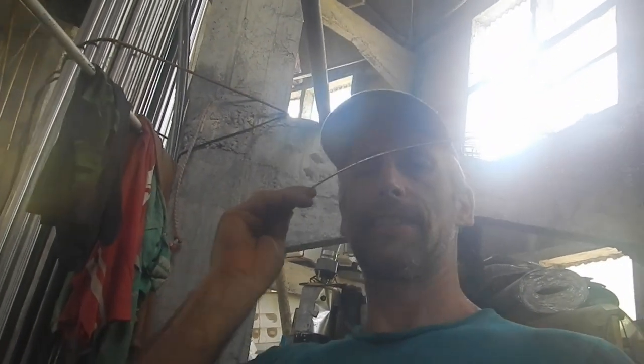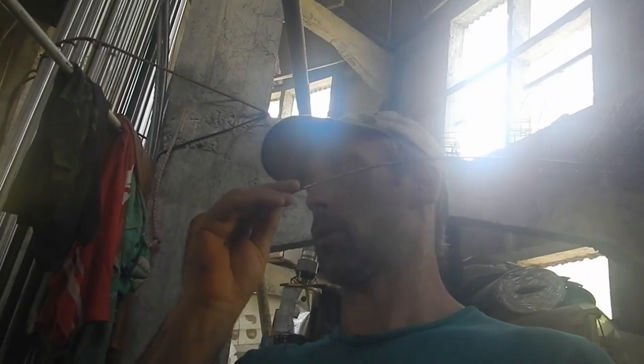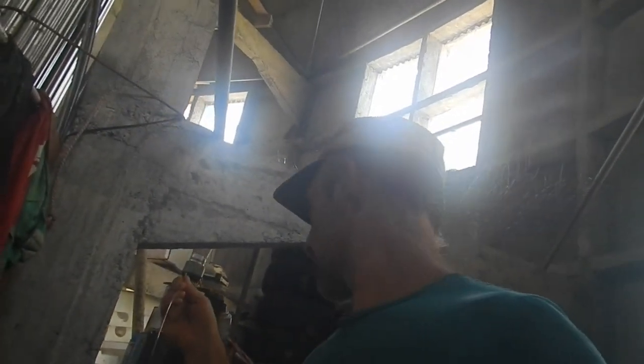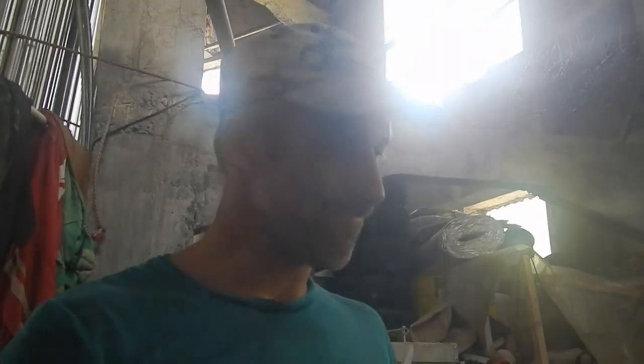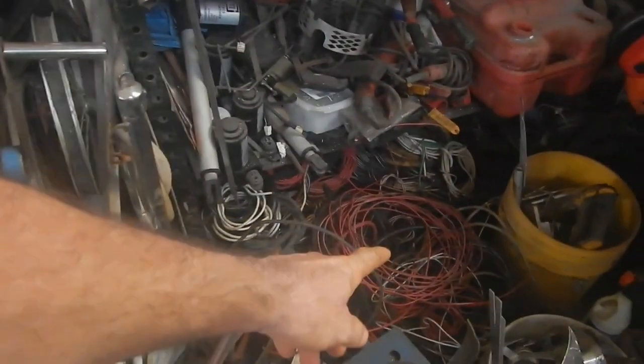And after like a dozen different things, I found this stainless steel wire I have a big roll of over there. And I took a piece and tested it on the car. With all these different things, I'm just holding them connected to the electrical stuff to see how fast it goes. Some things barely made any change, like a big piece of copper wire that was really long, which still didn't have enough resistance to slow it down much. And then I had some big fat resistors. Those slowed it down too much.